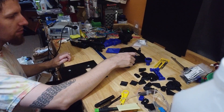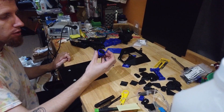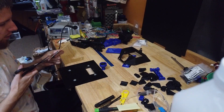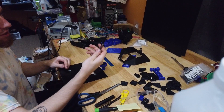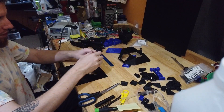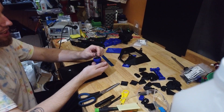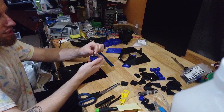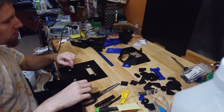That should be all the heat set inserts that we need. One other thing we're going to do — I printed this off, I'll put a link in the description. This is a nozzle torque wrench, the printed part of it. We then need to take one of these shanks — it's a hex to a quarter inch. Push that in, and then you put a 7mm socket on top, which mine haven't arrived yet. Once it gets to a certain tight torque, it will skip and not let you tighten it any further. So this is quite handy. I'll put the link down in the description.